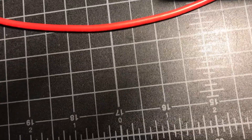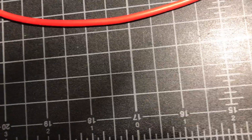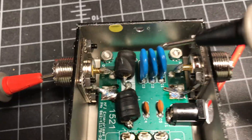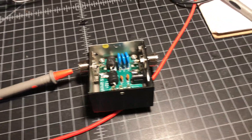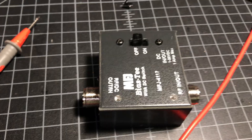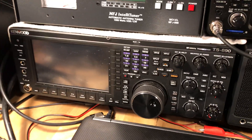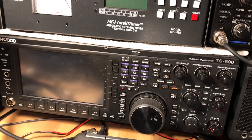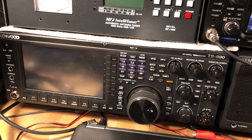We don't know why that is, but this is definitely shorted — something in here. I'm going to have to open this up to see what the problem is. This is really unfortunate. It's possible that feeding that 12 volts down there somehow could have destroyed the finals or the front end of this radio. I don't know, but we will see.